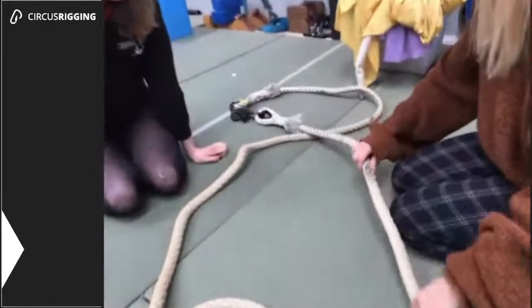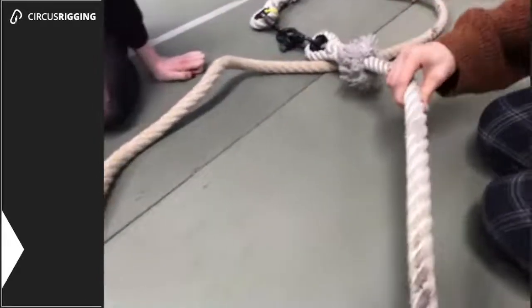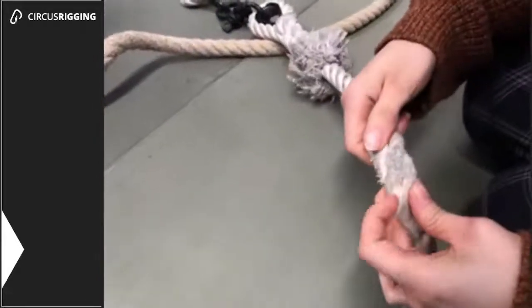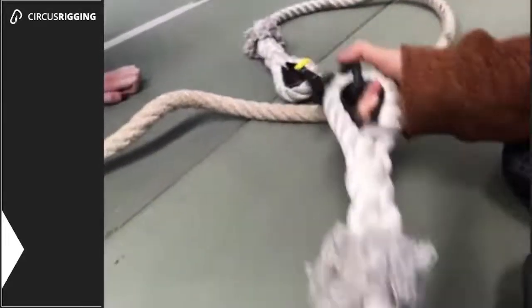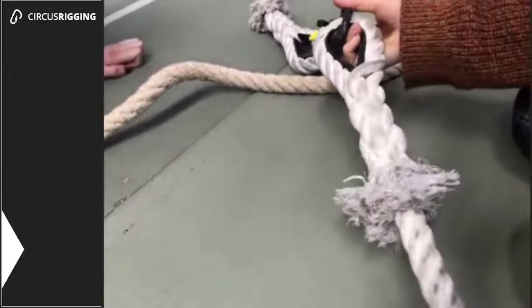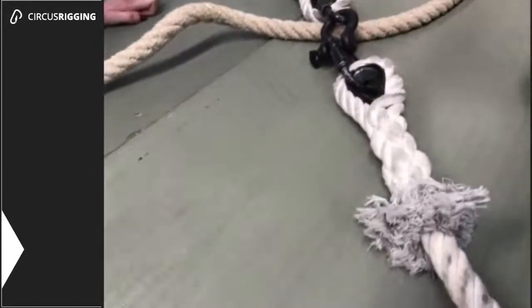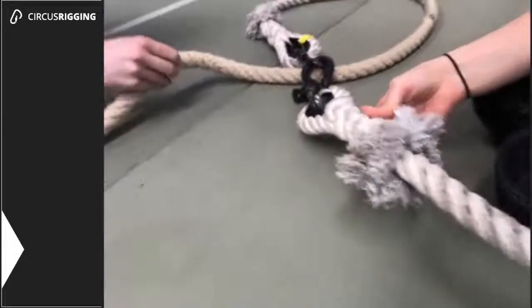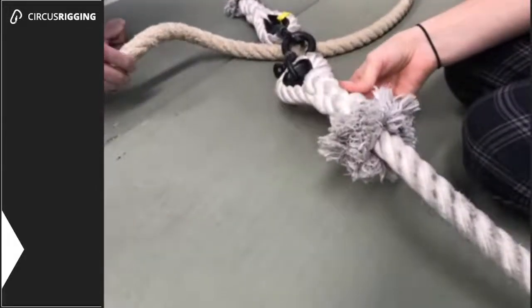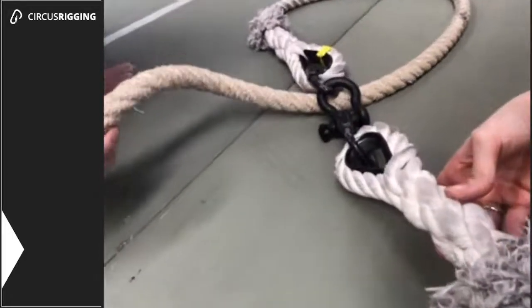Look for the obvious, cuts. It's most likely going to be, you know, you've perhaps taken it on the road and it's had a bit of rough treatment. Normally with cotton rope, if you see any loose ends like there are on the end of the splice, but somewhere else, then I would worry. But you've got to cut thread, it's got to go somewhere, hasn't it? But that looks all fairly together to me, because once it starts to get cut under load, it will start to fray open. Yeah, it's very, very visible.